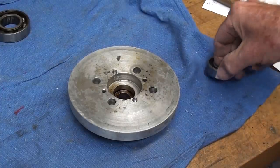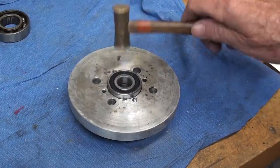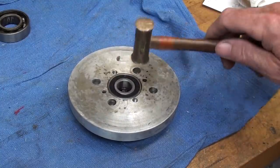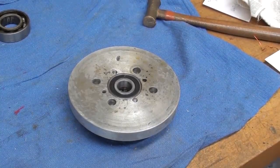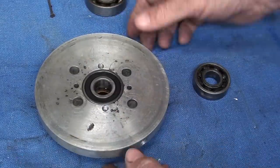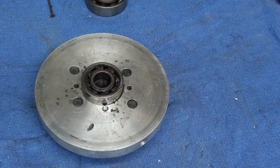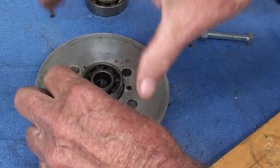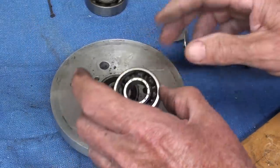That's what I'm going to do right now — rush over to the sink off camera. Okay, that bearing's in there; I don't want that seal to get damaged. One bearing is in, and that was the easiest one to install. I could have tapped it in with a piece of wood, drawn it in with a bolt, pressed it on the arbor press, or pushed it in with a vise — as long as you keep it straight and don't cock it.